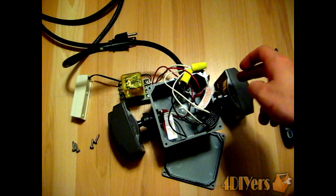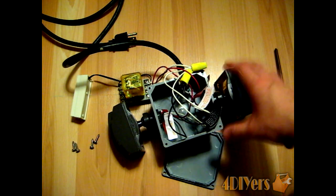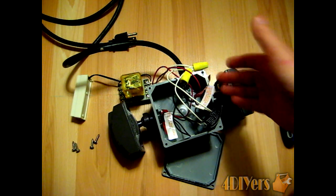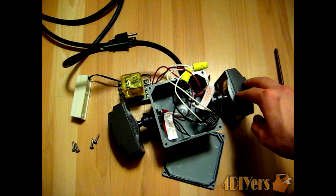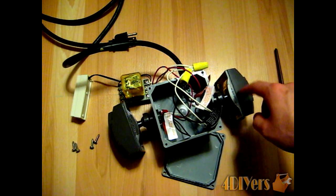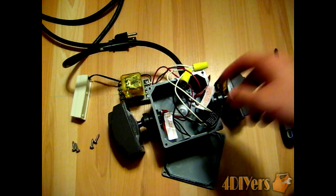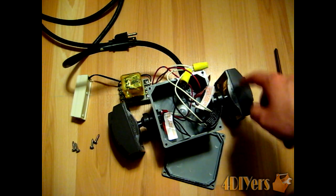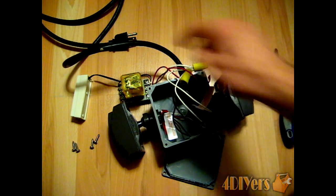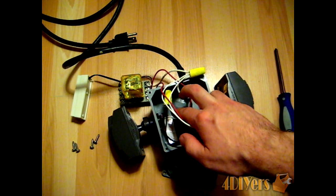Starting with the box and mounting the sensors — with two sensors I drilled two holes in the box and another hole for the cord. Some boxes come pre-drilled and others don't. The sensors can be bought individually or with a light assembly and were purchased from Lowe's, though other retailers carry them too. These sensors operate on three wires: a common wire coming in, a power wire, and a power switching wire. The cord coming in has two wires — a black power wire and a common wire.